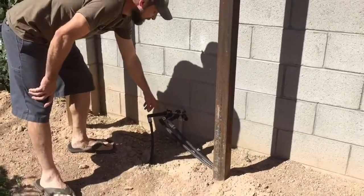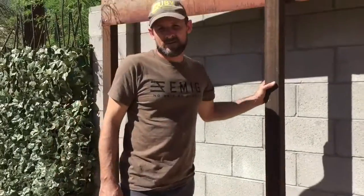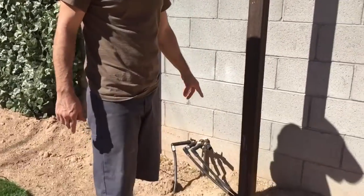These valves are simply turned on and off. The important thing to remember is you always have to keep one on, because if you turn off all the valves you're going to blow out your pump due to back pressure. So one valve must be kept on at all times — and that's basically how this system works.